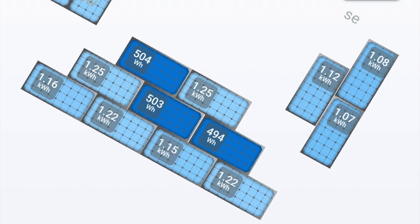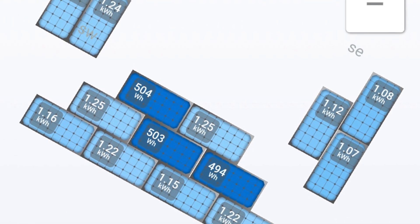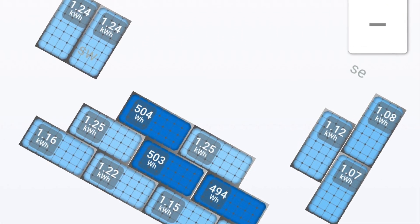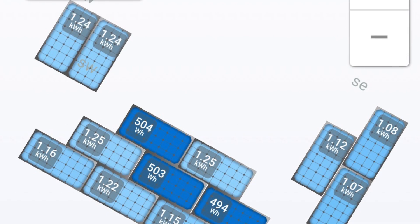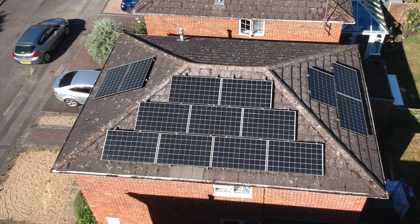Now it's over to Diara in Surrey who is going to tell you all about his installation. I, on the other hand, have taken a different approach to solving the problem of shading. My roof has four surfaces each facing a different direction. I have 14 panels in total — three facing southeast, nine facing southwest, and controversially two facing northwest. Because of this, the amount of sunlight hitting each panel at any given moment will vary significantly, so for me a string inverter would not be the best solution.